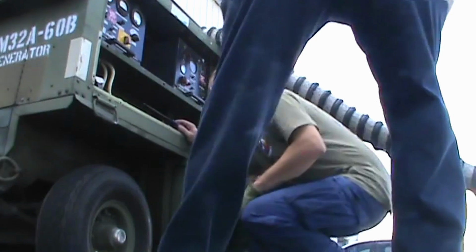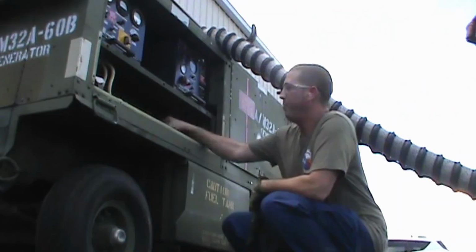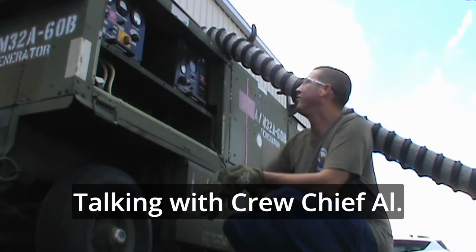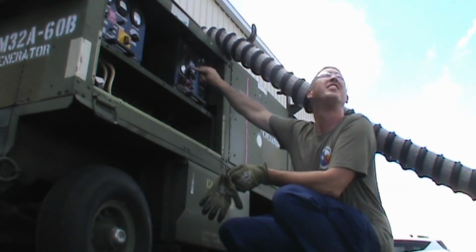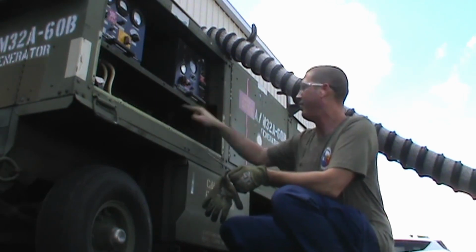Yeah, on this side, isn't it? So you had to dig for it. So there's the tachometer there. Okay. That's the centrifugal switch assembly. Okay. It's that middle one, and counterclockwise will decrease its set point. Clockwise. So according to this, I'm getting 96%. Is a red, green light coming on, the load light? No, and that will never come on until that closes.